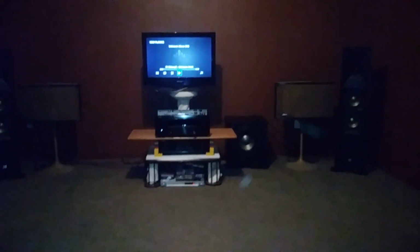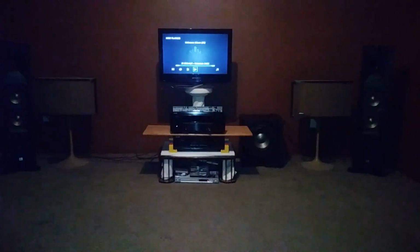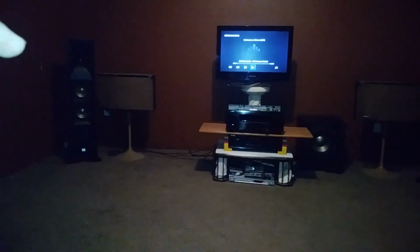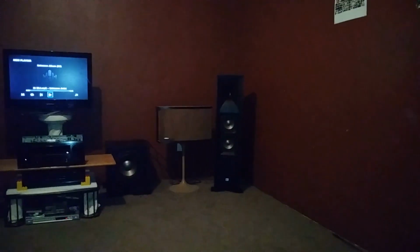At some point, I'd like to get the other towers and set them up next to these, and use the switch box biamped. That way I can use the 590 bass drivers with the 580's compression driver, you know what I mean? Because when I was using just the high frequency horns with the N28s, the 2.5 way aspect made a difference, so there's definitely something to that. I think the woofers make it harsh because they're throwing in all those high frequencies, and then it's clashing with what the horn is doing, and it makes it harsh like that.